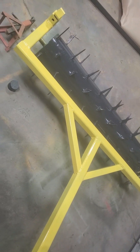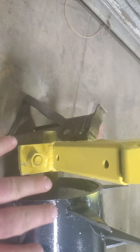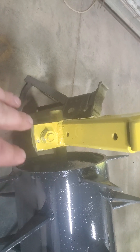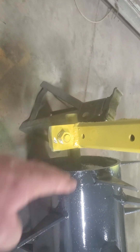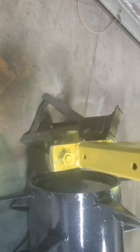It should do what he wants. The only issue I think it may ever have is because I used an inch-and-a-quarter shaft all the way through this thing. The bearings are inch-and-a-quarter pillow block, but the set screws that lock that are fairly small. You may have some shifting going on right here, and when you pull it, it may want to walk over because they just won't keep it tight. I think they look like quarter-20 allens. If it doesn't hold, what he'll have to do is put a collar right here on the inside so that it won't shift and foul the aerator up against the hitch.